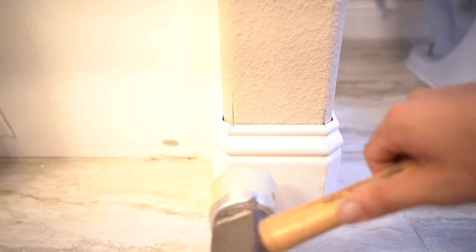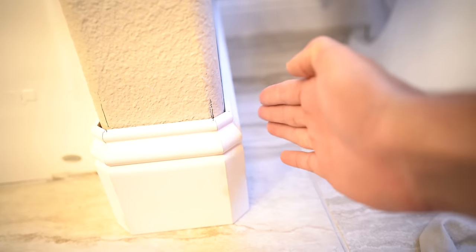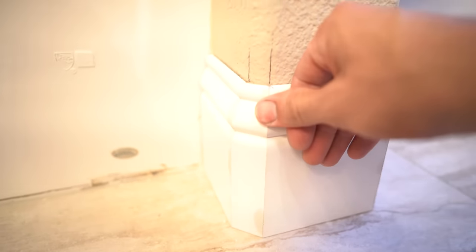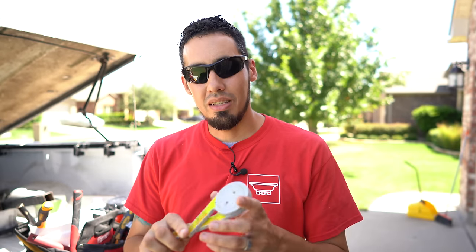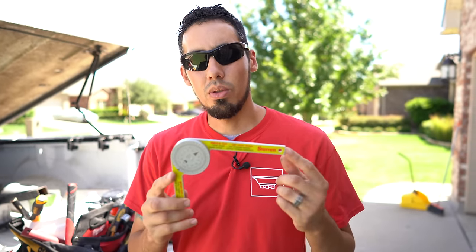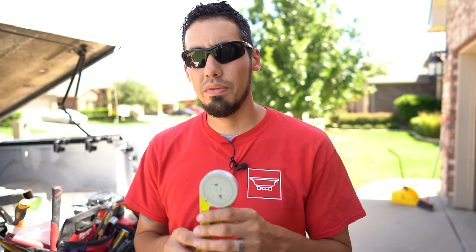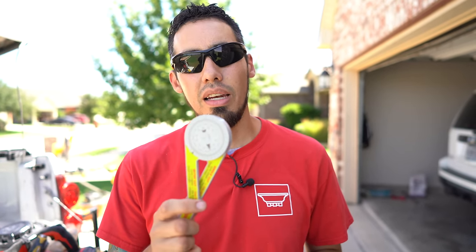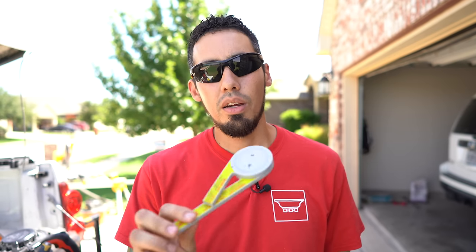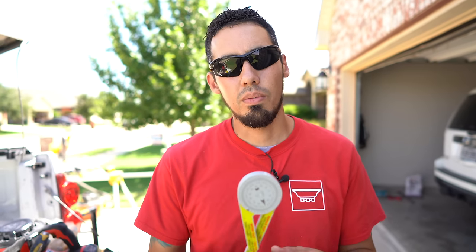Now I like to finesse things into place. I got this flooring hammer and I like to hit these and kind of finesse them in, and kind of hit those copes in place too because sometimes they're a little tight. But really that's all you need — get some nails in it, you'll be super good. That's the Starrett miter saw protractor, my favorite tool on the job for making miters and doing finished carpentry. It just turns it into a complete no-brainer — tells you what miter to cut. Hopefully you enjoyed this video, thanks for watching, we'll see you on the next one, take care.